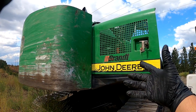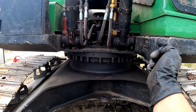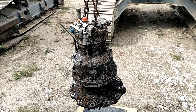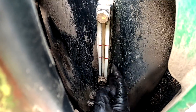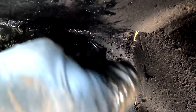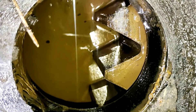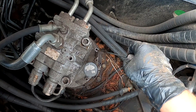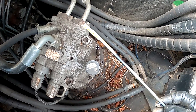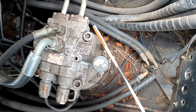We successfully located the hydraulic leak without any visible leaks. In this video I'm going to show you how to remove this swing motor. As you can see there's no hydraulic oil on the tank gauge present. It all went down inside the slewing tub. The swing motor pinion gear seal is leaking — when you pull the dipstick out you should only see gear oil between the lower and upper marks, but we are way higher, and that is all hydraulic oil.